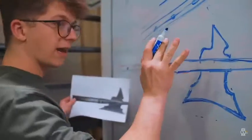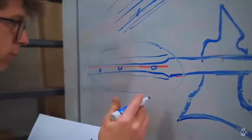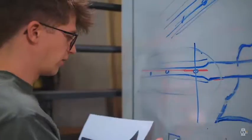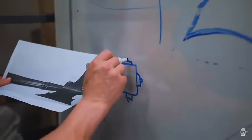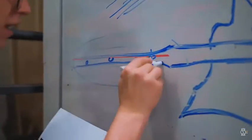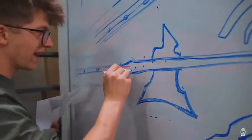Oh boy. Okay, so this area here, this is where it connects to the wood, and I thought it was just strapping on the side. It's not. If we were to cut this here, we would have a square wooden handle. There is then steel on all 4 sides of the wooden handle with rivets going the entire way through. That means that there is strapping like this on all 4 sides of the handle, which means that it needs to be welded all the way around, which is going to be really difficult.